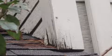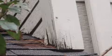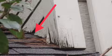You can see this trim board in this photo starting to show some signs of rot. But what I really want to point out is that your siding should be separated from your roof by a minimum of one inch, and preferably two inches, to keep moisture from wicking up into the siding and causing this rot.